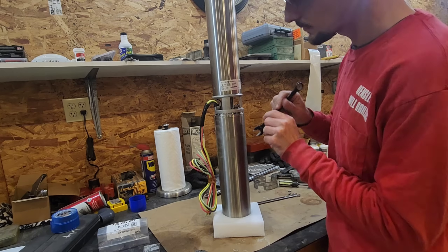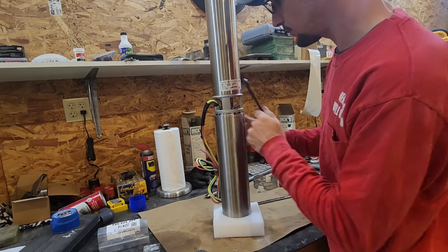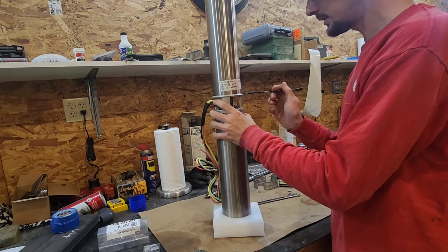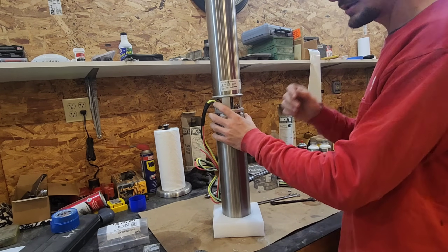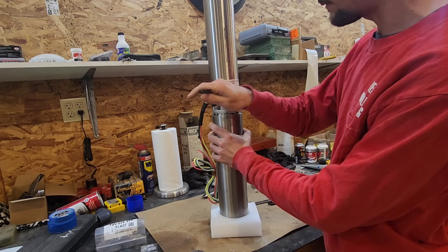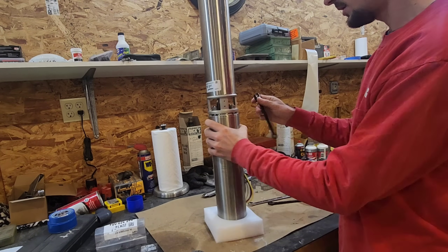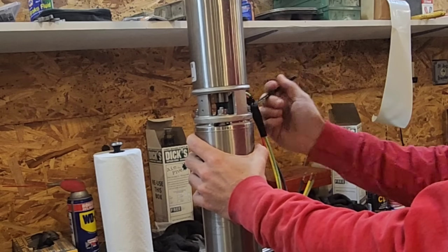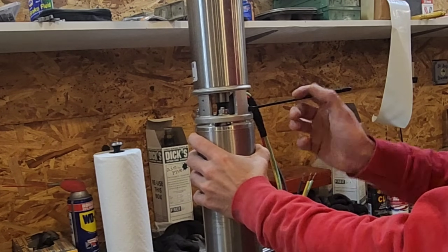The issue is this is actually for a water tower — it's one of six that feeds the water tower. He told me it was essentially his main supply. This is only a 20-gallon-a-minute pump, but the crazy thing is it runs non-stop — probably 20 hours out of the day — because the well makes so much water. The other five hooked up to feed the water tower don't make as much water as this well does, so this pump gets abused while the others cycle on and off on a timer to allow the well to recover.